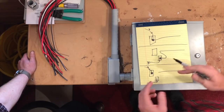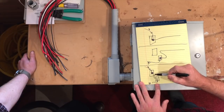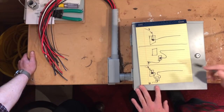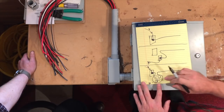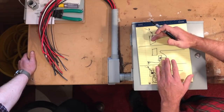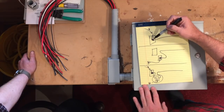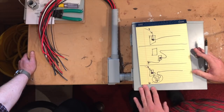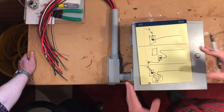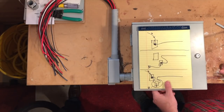I've got a generator, and the wire coming in happens to split for two power lines as well, just like the city power does. There's going to be a circuit breaker on there, and then this wire hooks into that. Completely separate. The magic happens here — you've got power coming in from the street and from the generator, and the transfer switch decides between whether we run power from the grid or from the generator. It's completely separated so you're not feeding backwards into the grid. You could get into big problems if the streams crossed.